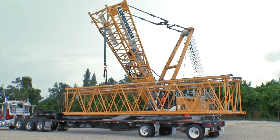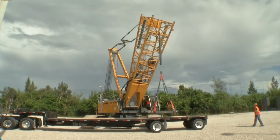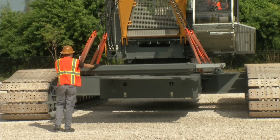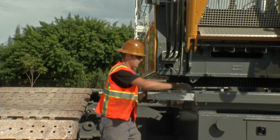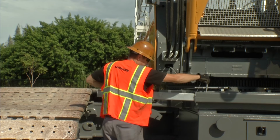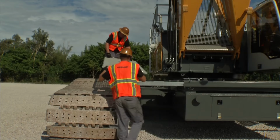It can be transported under the boom sections to save space. After both car body counterweight slabs have been fixed, mount the platform. For transportation, the attachment beams of the platform on the undercarriage are slid into the car body counterweights. Pull them out and fix them with pins. Make sure that all pin locks are mounted.